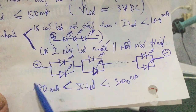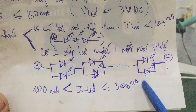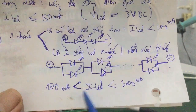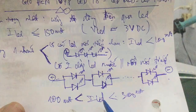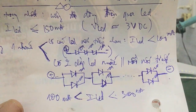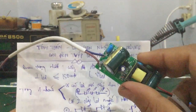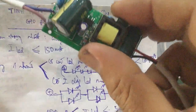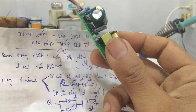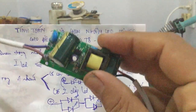It falls in the range of 100mA to 300mA — above 100mA is okay. This current value is what you measure in no-load mode. Because you should know that this LED driver power supply is a constant current source, meaning the output current will not change whether you measure with load or without load. However, the output voltage will change depending on the load.